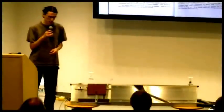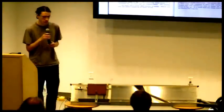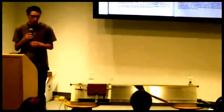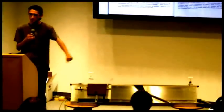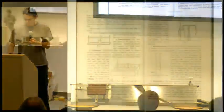The question was, how's the linearity of motion? Like, do I have to do any correction for the motion not being very constant? And it seems pretty good. We've looked at the images and haven't noticed any disturbances. The motor is a stepper motor, and it has a very controlled motion. And the belt that we're using is a timing belt, the same as in a regular scanner. Earlier, we had experimented with ways of correcting for that using kind of a pattern that's on this saddle.